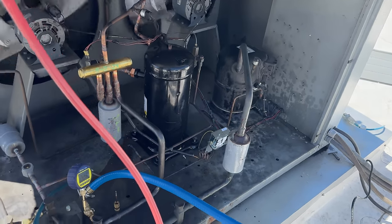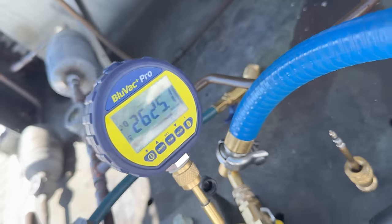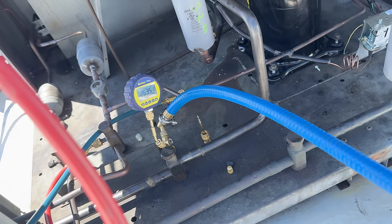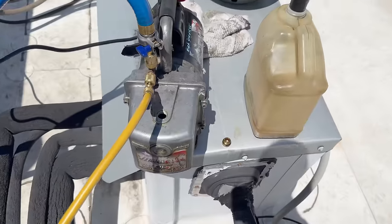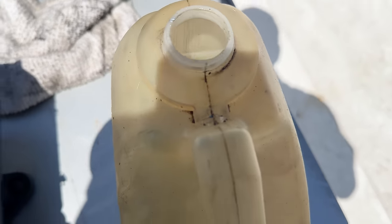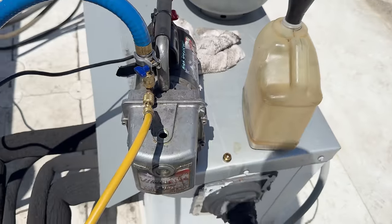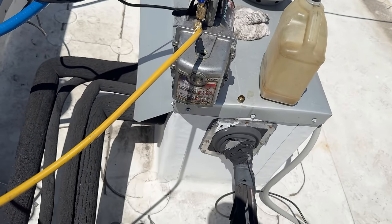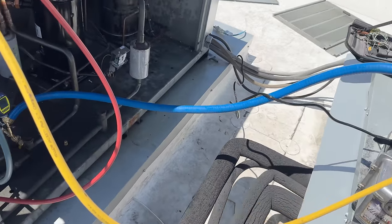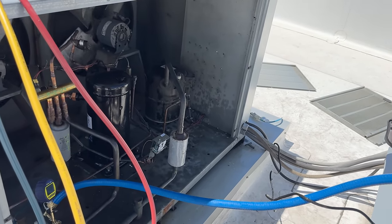We just pulled for a while — the big hose is bound off. Best we can get so far: 2,600 microns. She kind of bogged out. Oil looks like hell — you can't see anything, it looks like milk. This thing's saturated with it, and we're just about out of oil. So yeah, doing great — pressurized blue oil and stuff. Going great.